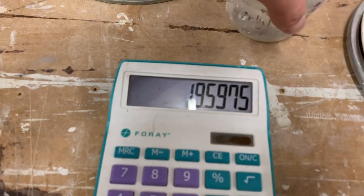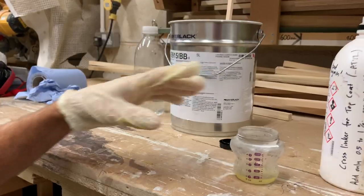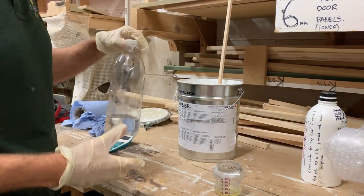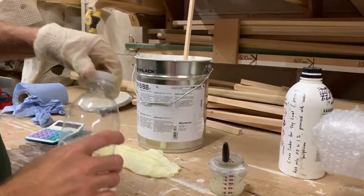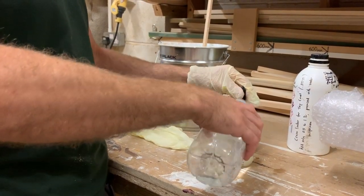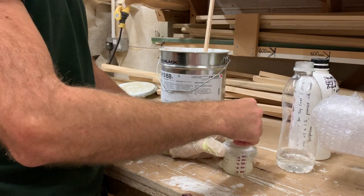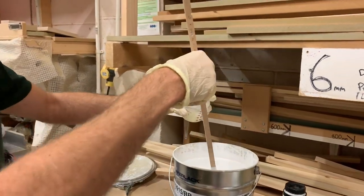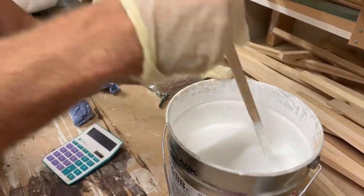So we're aiming for around about 20 millilitres. Now because it's very thick, we'd have trouble mixing it straight in as it comes, so what MOVAC recommend is putting some warm water in. There's no harm in that because Brady normally mixes in around about 500 millilitres per five-litre tin, which is around about 10% — usually about the maximum recommended to thin the paint, as it goes through the spray machine better that way. That's ready to go in — should be good to go.